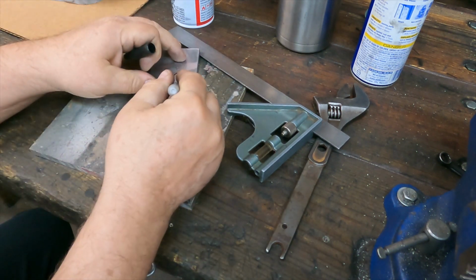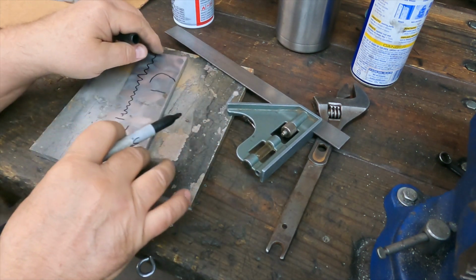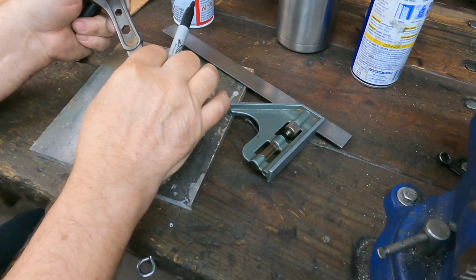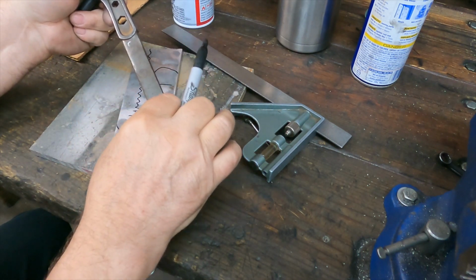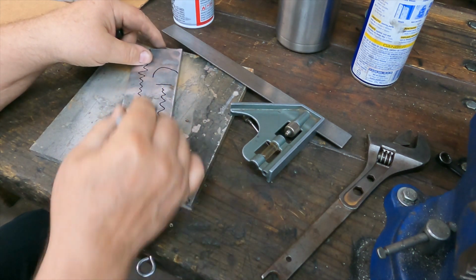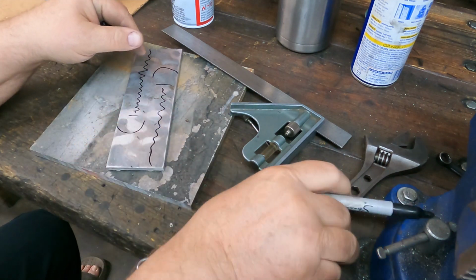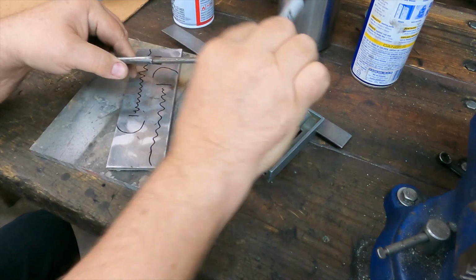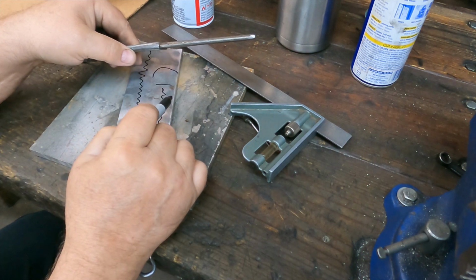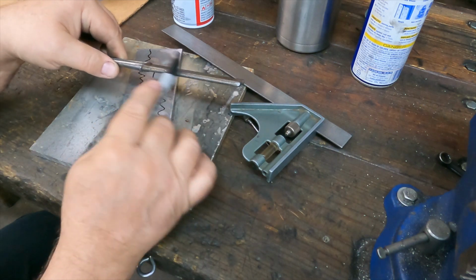The 2 scales are going to get milled down the middle about 800 thousandths of an inch, because the tool through here is about 800 thousandths of an inch wide, and they're going to be about 1/8 of an inch deep. So we're going to mill some slots in these things. Each one is going to be 0.125 inches deep, because at its widest point, this tapers a little bit to the end. This is 0.250, quarter inch. So we'll cut 2 1/8 inch deep slots in it, epoxy them and screw them to this part of this forging.